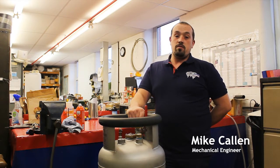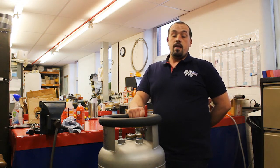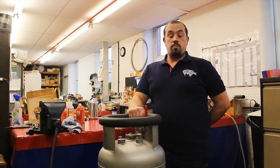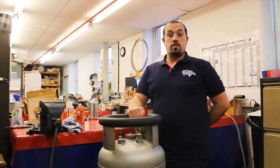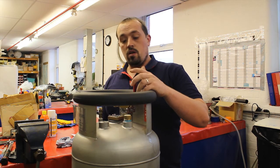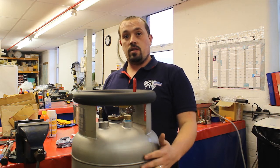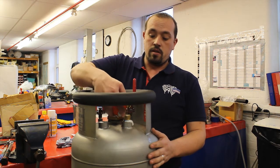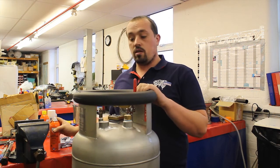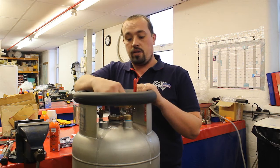I'm Mike Callan, the inspector here at Cameron Balloons. I took over from Clive Brown a few years ago. Today we're going to talk about cylinder maintenance and inspection, especially from a pilot's point of view — the things that you are allowed to do, and a small insight into what we do here at Cameron Balloons. This is one of our new cylinders built to customer specification. Once the cylinder has been assembled, we fill it with compressed air, then look at the exterior for defects and damage, and also leak test by spraying around all the joints. If you see massive bubbling appear around the joints, you know you have a leak.